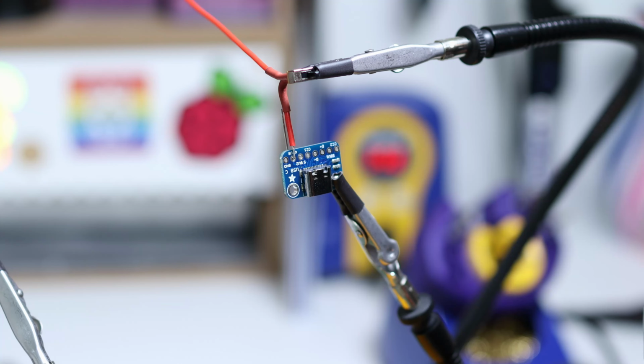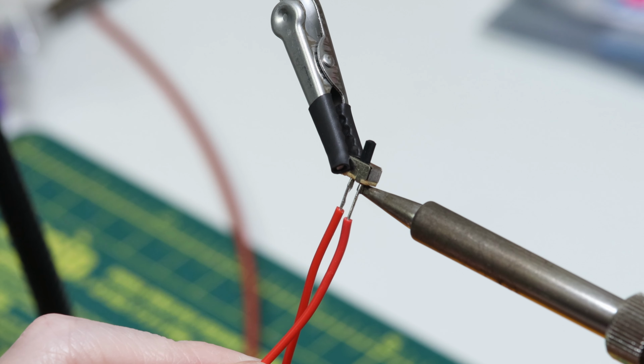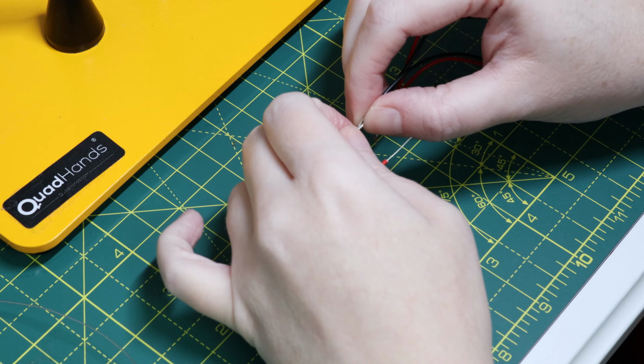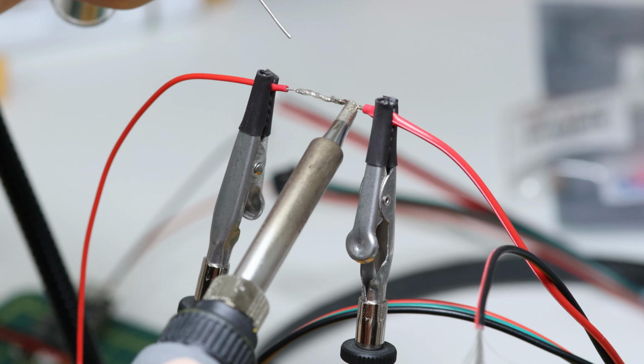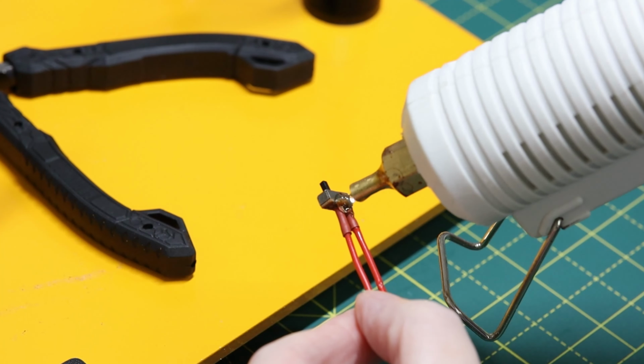You can't make light without power, so getting this circuit sorted had to come first. Hold on to your butts. It's about to get real nerdy in here. I trimmed off the extra pin on the switch and soldered the center pin to the V-bus on the USB breakout board, while the left pin got soldered to the wire that would send the power onward to the rest of the project. The ground on the breakout board was paired up with the power wire from the switch and spliced to send power separately to the microcontroller and LEDs. Hot glue keeps the precious solder joints safe and secure, and we're on our way.